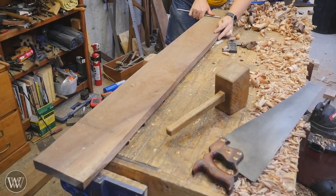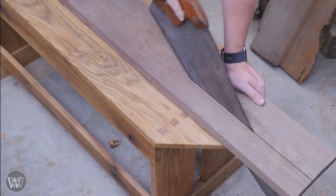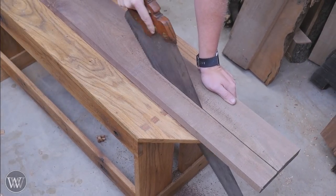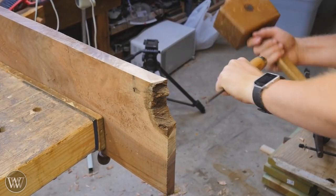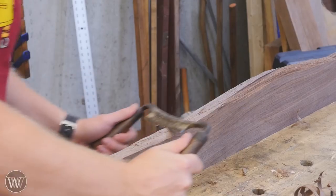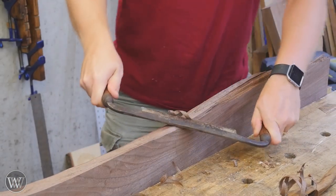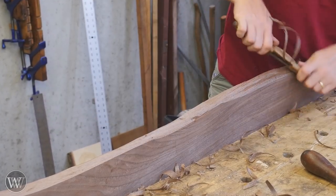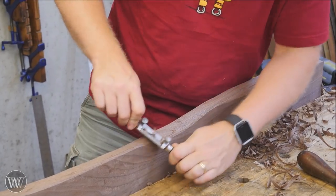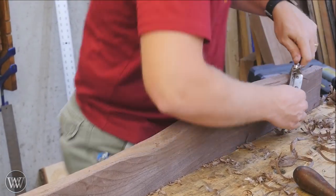The last bit of lamination is putting black walnut on the front face and then on the back skirt. The front face will be ripped to four and a quarter inches just like the other pieces. I didn't laminate it into the other because I want to put a dovetail connection into the end cap as opposed to making a full sliding dovetail all the way across. The back skirt I want to have this live edge — it had this really cool bark in it and the bottom edge was wavy and live edge. So I want to clean up the bark using a draw knife to do the majority of the removal of the waste, and then come in with a series of spoke shaves. This is actually a spoke shave I made in an earlier video. I love using this thing — walnut is a pleasure to work with.